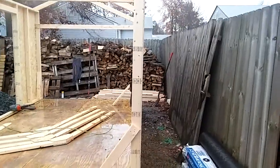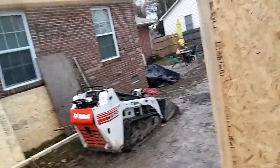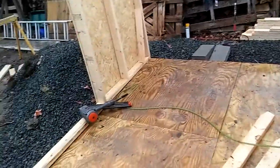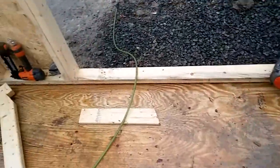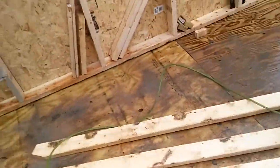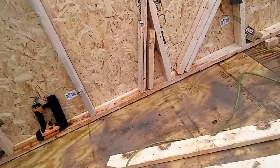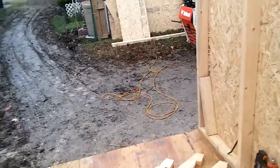It looks like the front one is out to the right — no big deal. Look at the bottom of my plates. I still don't have blocks under the centers because I want these corners to stack up nice and tight before I get the sheeting on. They'll always stack up tight like this if you leave all the center blocks out, since nothing's holding the shed up except those corners. If it starts dipping too much, just throw something temporary under there so it won't dip too much.